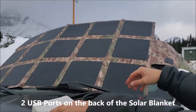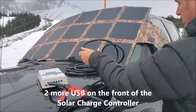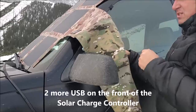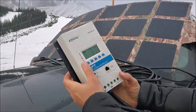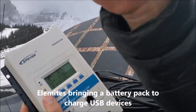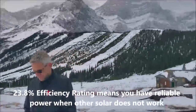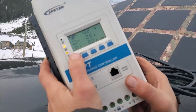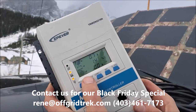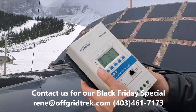We're at 14% right now. All you do is connect your Anderson SB to that and directly to the solar package. We've got a bit of snow and moisture in there, but that's okay — these are designed to work in pretty harsh conditions. The battery just went from 13 to 15%. We're at 0.7 amps. We have no direct sunlight right now — we're behind quite a bit of clouds — but right now we are at 10 watts going in, 0.7 amps. We've gone to 14%. We do have the fan running and the lights on just to draw power too — 0.8 amps. So for these less than ideal conditions, it actually works quite well.